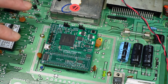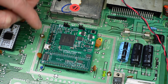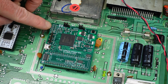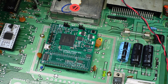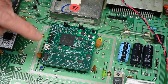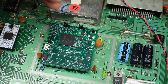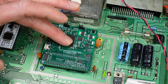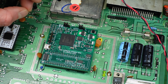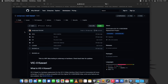It can do several things more. Specifically, it has an HDMI output implemented by this micro HDMI header here. You also have this unpopulated header, which gives RGB out and VGA out. It provides the old school video output from the DIN and also all the modern output formats. However, this is not going to be compatible with all monitors — there are some quirks, some strange resolutions, because it has to be kind of pixel perfect for this to look good. Some monitors are going to support the resolutions, some aren't. Let's take a look at Randy Rossi's GitHub for the VIC-II Kawari.